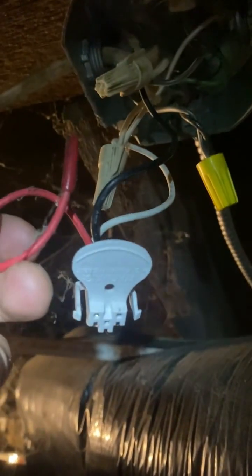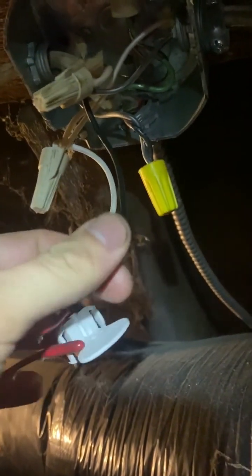I figured out what this thing is — I think this used to be part of a smoke detector or something. That's why there's this confusing connection, but it doesn't seem to be needed at the moment so I'm going to remove that too. I don't know if there's a shared neutral going that way or some other circuit, so I'm just going to play it safe and test all the voltages on the hot and the neutral versus the ground, even though the breaker is off. With a shared neutral you can get shocked, so don't want to do that.